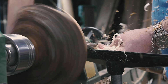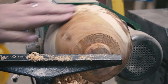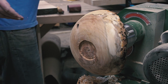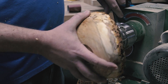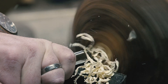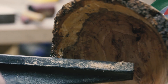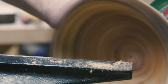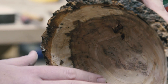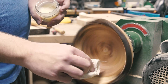Plus it was sopping wet, so the uneven weight was amplified. Once I had the bottom of the bowl shaped, I cut a dovetailed recess in the bottom and flipped the piece around to hollow out the bowl. At this point it's hard to say if I'm turning out most of the crazy figure trying to get that live edge feature, or if it's showing up in the walls of the bowl. Once I had my wall thickness close to where I wanted it, I grabbed my newest favorite turning tool — the left-hand bowl scraper. It's just big and beefy and leaves an incredible tool finish. This little cherry burl had some incredible grain, but nothing like that woodworker's fairytale maple. I dream about what I could make with that stuff. In due time.